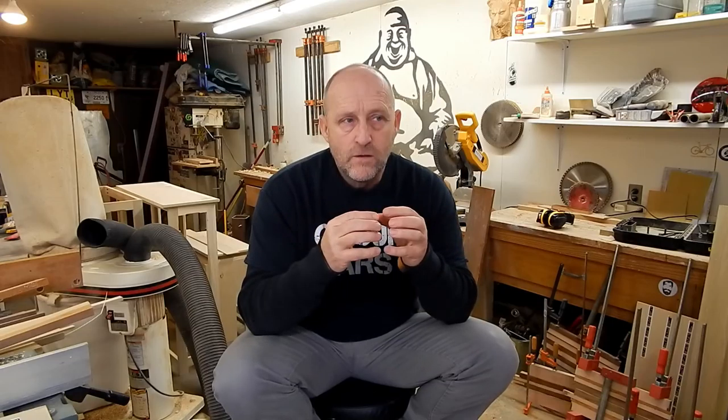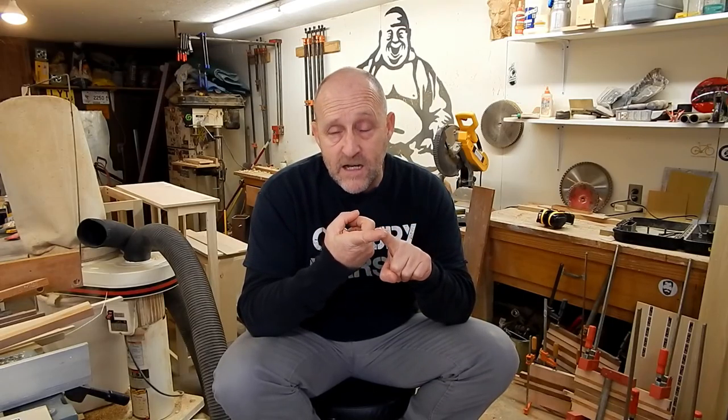I just do what they tell me to do. I use the best epoxies I can afford. I use a lot of West Systems because to me they just have it down right. I don't very often go with lower end epoxy. I will use a digital scale that gets it right down as close as it can possibly be. Keep your temperatures right — that's very critical to curing. And finally, get to know the material. Experiment as much as possible. Use it on some little things that are going to be thrown away, just get comfortable with the chemicals. Those are just a few pointers that will help you with epoxy work.